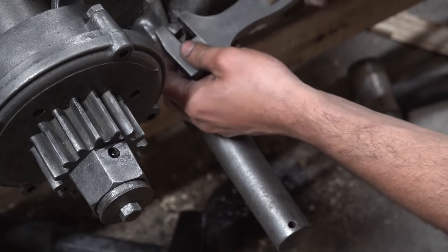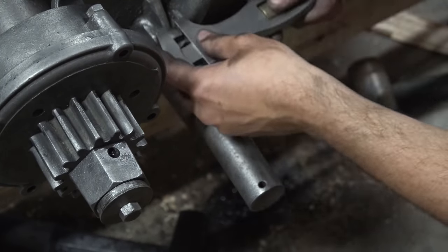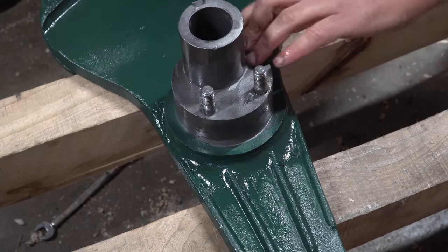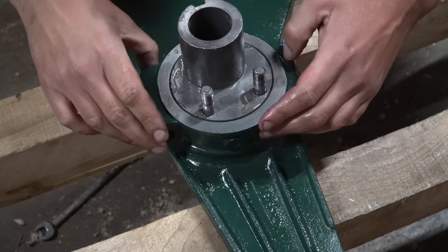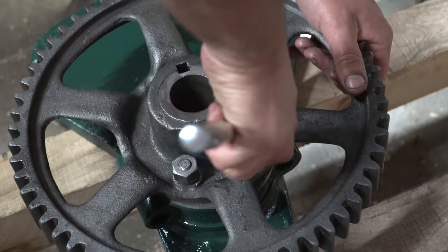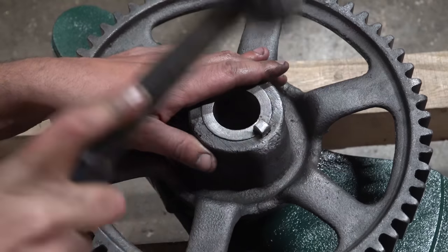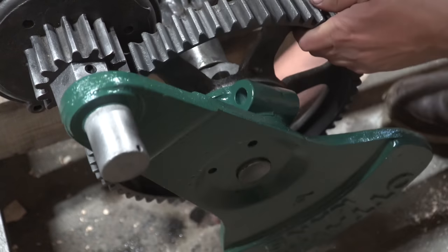This is the shaft that the entire saw arm mechanism turns on, and I actually ended up completely remaking this thick shaft. It was too worn — when I would spin the flywheel the saw arm was not safe looking at all. So I turned it brand new out of stainless steel and it's much better now. You can see the saw arm go together here. The big gearing is probably fine with just some oil or grease. It's usually a smart idea to put the key in before you assemble things, but luckily things are loose enough that it doesn't even matter.